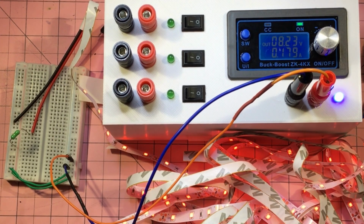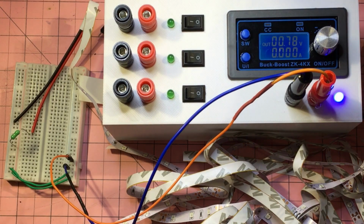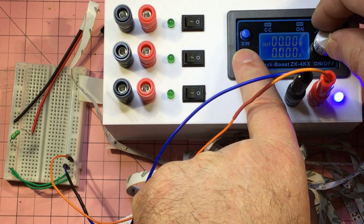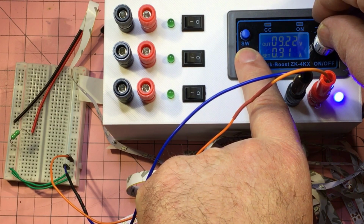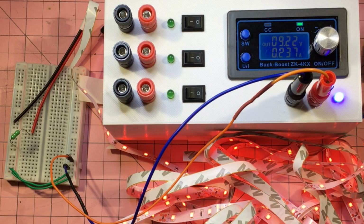Okay, 180. Is it a time thing? I mean, 180, it should be blown. Let's, yeah. Tell you what I might do. I might set this up to be something like 9.5 volts and see if it goes straight away. That's not really supposed to be the way to go, but anyway. So we'll go to 9. Yep, we'll try that. All right, here we go. 9 volts. 230. Current's fine and holding at 230. Unexpected. All right, good.